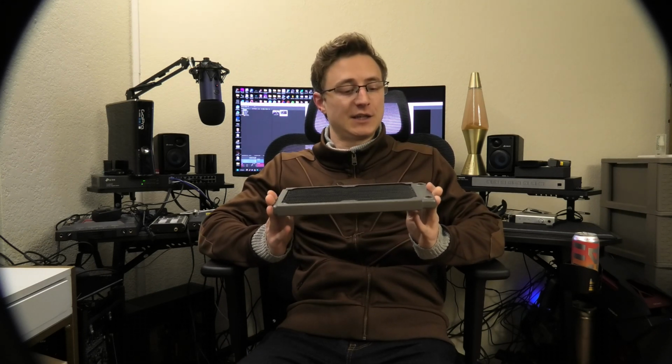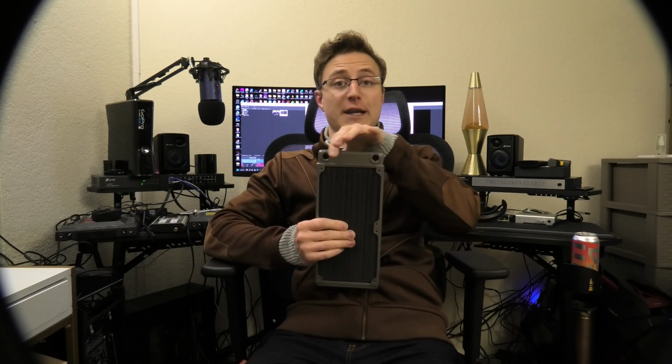Now, something else that I've realized is that, unfortunately, my initial plan of creating a little distro plate to allow the running of the water in a very slim channel outside of this thing doesn't work, because the way that it's mounted, even with the fans in place, does not allow the mounting of the actual fittings that I have, which means that I have to come up with a different solution. So far, my next solution is to use copper piping, which is going to be relatively slim. I'm also going to be brazing G1/4 inch adapters into that piping, which will then allow for a really slim channel to run outside of here and then go into the rest of the server chassis and into my pump.